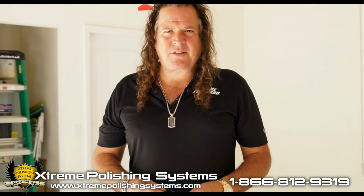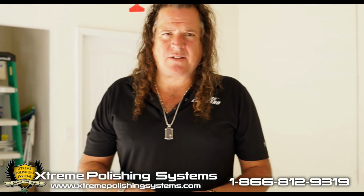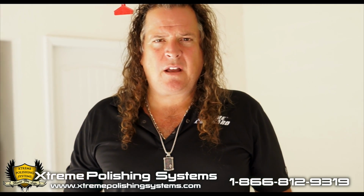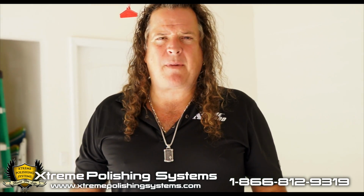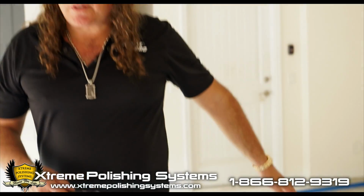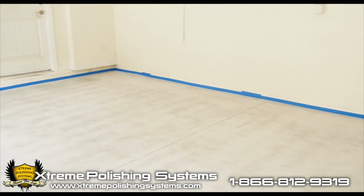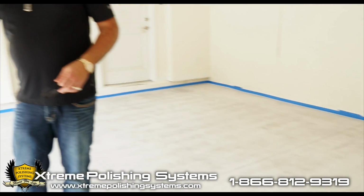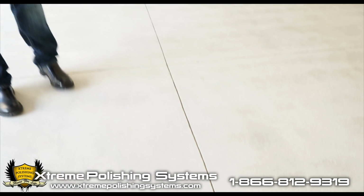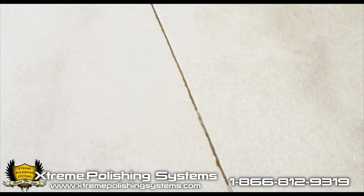Okay, so the process has begun. Obviously, we've prepped these floors yesterday with our concrete genie, and we used the 16 grit metal bond diamonds to grind the floor, okay? We've taped off all of our borders and our edges. And what we have here is we've cleaned out the middle joint. We vacuumed out all of your construction joints in the floor, as you can see.